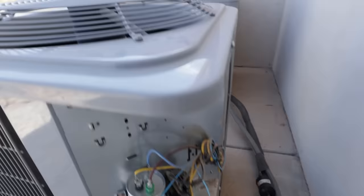Lane is now turning on the breaker switches and then he's going to go upstairs and turn on the AC unit. This is the part where we see if the fan turns on and the compressor turns on — we're back in business. If it just buzzes, we're still in trouble. It's not working. While we're troubleshooting this, when I hit that power wire, it shorted out. I'm thinking I blew a breaker somewhere.